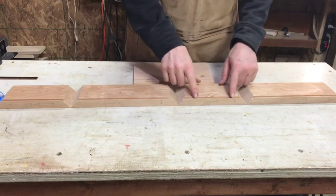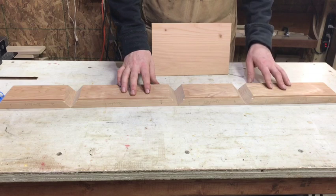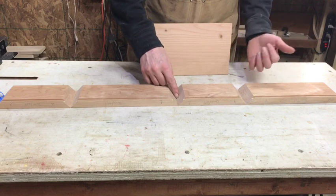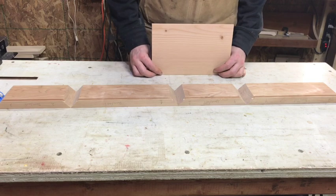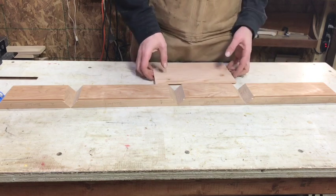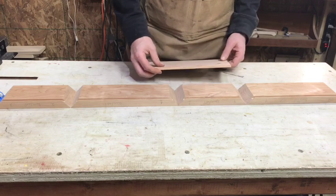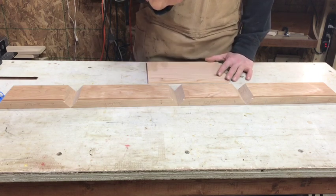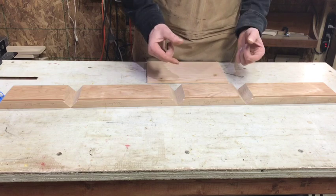To do our sliding lid we need to cut a groove on the mitered box. On a mitered box this is pretty simple — you can just run it through the router table. If you've used box joints and don't want to do plugs, you need to do a plunge cut either on your router table or with a plunge base router. I've seen people do it on the table saw, but that seems sketchy to me. A flat piece of wood or a cupped piece of wood for the lid are the two you can work with — if you get a really bad twist it's going to be very hard to get the front lip to sit flush.